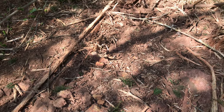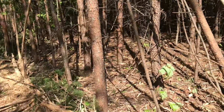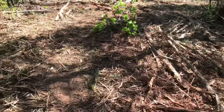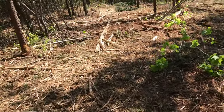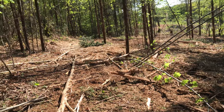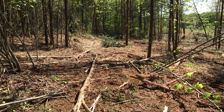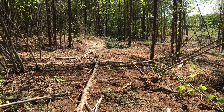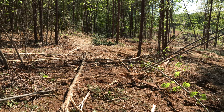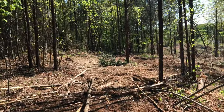I need to geotag these rock piles because he can cut a little further on this one, but it's not going to be good to drive a trailer over them — these are not all-terrain trailers. So let's talk about the next step. Let's say he's cleared it up, it's perfect for horses and four-wheelers, it's 21 feet wide — but it's not level. Well, because there are no trees on it now, I can simply get a bobcat or somebody with a bulldozer and we can start digging these trails out level with a drain grid, because we're going to assume the water runs off once it's hardscape. But I don't need permanent roads until I'm sure what my design is going to be.